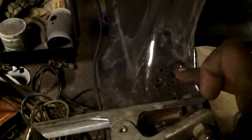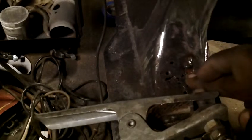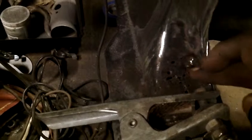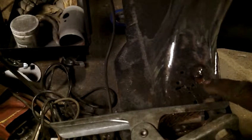Here, the actual weld is going through the copper, but it won't stick to the copper. So when you start welding, you weld on the copper because it's not grounded there — it will not weld on this. You create your puddle on the copper and then it melts into the metal, then it becomes grounded to the car. Once that happens and that starts, you can then start welding to your weld and it will melt into this thinner metal and make it strong.